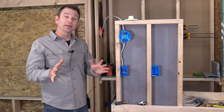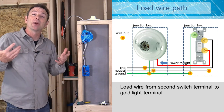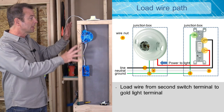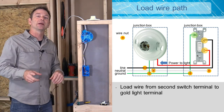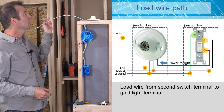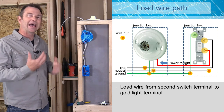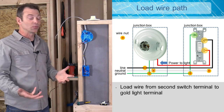If you pull up your schematic, we're going to post it here — it'll be our map that we'll follow. I'll show you how that switch leg translates to this mock-up. As you see on the schematic, you're going to have your power coming in on a 14-2 wire. We're going to add another material into this exercise: a 14-3 wire.